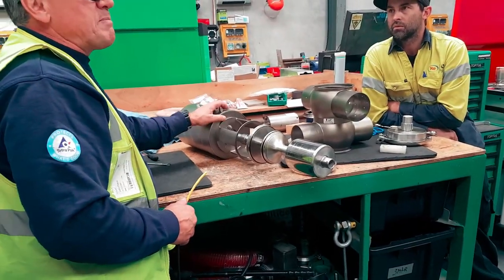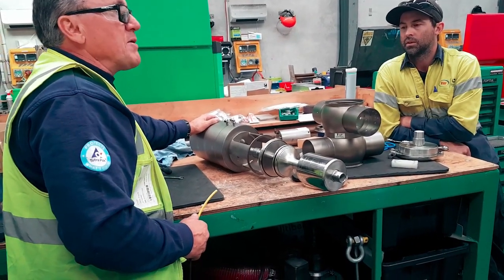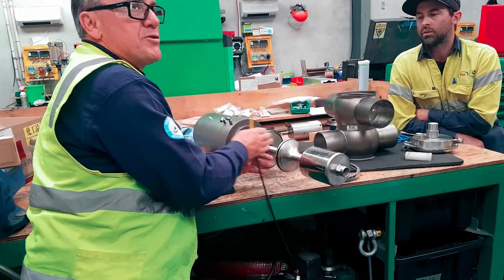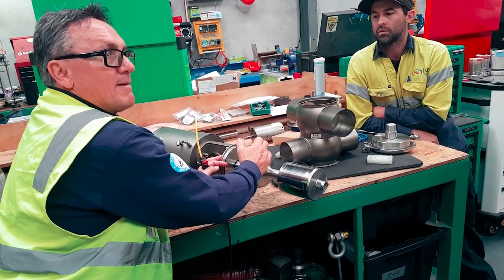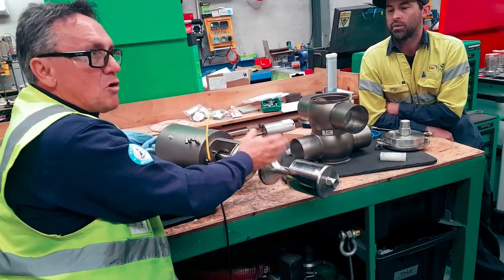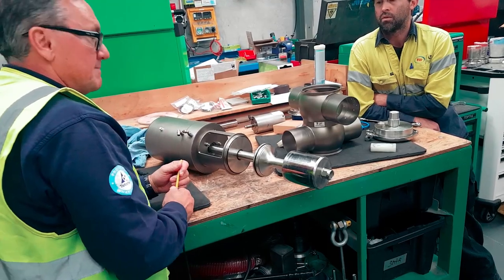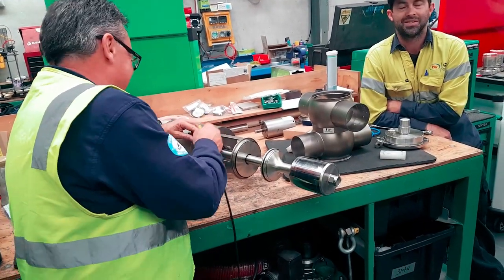You've got three compartments in here, and they're all doing an individual job. They don't work simultaneously, they don't all work together. So when this is inside the manifold, it's loaded with all the air off it. This is actually loaded, putting pressure on like the spring, on everything. So when you've got it out of here, you've lost that load, therefore you've got some tolerances in here that, if you put air on there, you're going to cause problems. All you need to know: don't put air there.